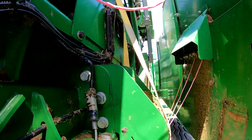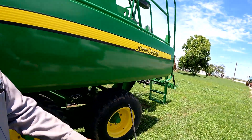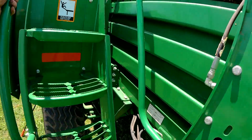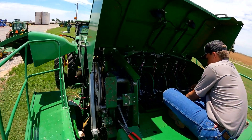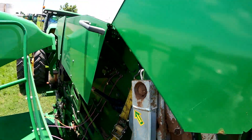There are a couple of things about that second knot that are really important on a high-bale large square baler that's got a lot of bales on it. So we're going to step up here on the back of the baler, get up to our knotter assembly — we've got our needles in the home position where we ran the needles all the way up through the knotter frame.